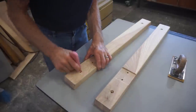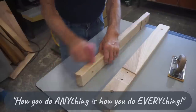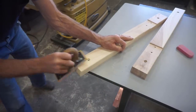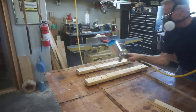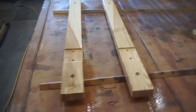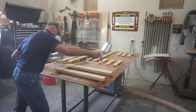Trolls will no doubt accuse me of overkill, but I follow my 'how you do anything is how you do everything' credo, so I use a jumbo oops eraser to clean up layout marks and 150 grit sandpaper on a bodyman's sanding block to remove sharp corners, router burns, and smooth up all the faces of these blocks. These nice-looking boards get a full wet seal coat of Sherwin-Williams pre-cat lacquer to lock down loose wood fibers. This product dries fast enough in a warmish shop to sand and finish coat within an hour, so I shoot on a second coat and set the pieces out in the hot sun for another hour to cure out before handling and assembly.